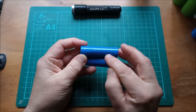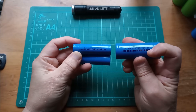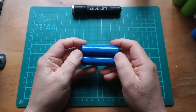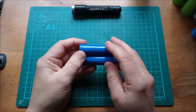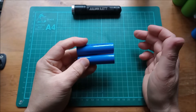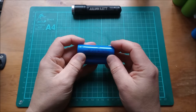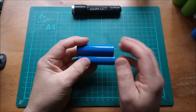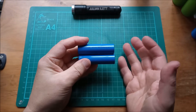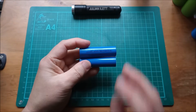There isn't much in the way of identifying numbers on here. In fact, when I look at the reference code, it's actually the same as the code on the 26700s. These are rated at 1300 milliamp hours. The ones I got previously - 18650s - were rated at 1500 milliamp hours, but they said charge to 4.5 and discharge to 1.5, which seemed a bit excessive. These are rated a bit more sensibly at 1300 milliamp hours. The ratings are charge to 4 volts and discharge to 2 volts, which was the range I concluded was sensible when I put one on the discharge tester.